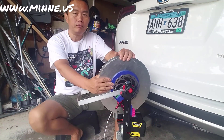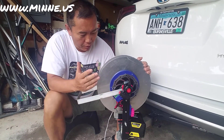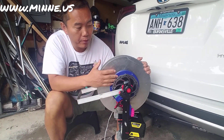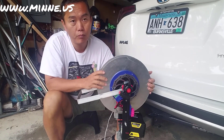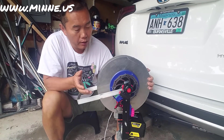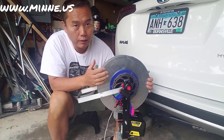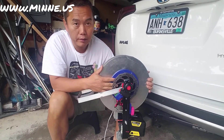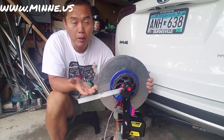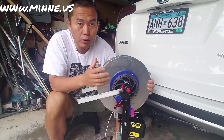The pros of the hub motor: it's very simple. The hub becomes part of your spool, part of your winch, so it's very simple and maintenance-free. This is a 1000-watt hub motor, but you can go up to a 5000-watt hub motor — maybe even bigger. Once you go bigger you can actually use regenerative braking as your tension control.